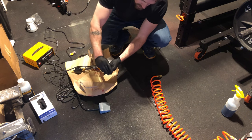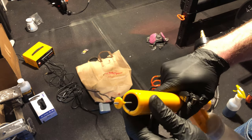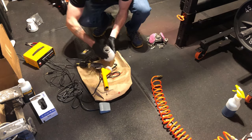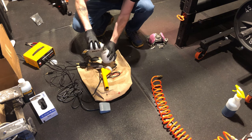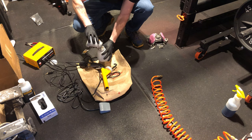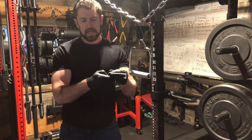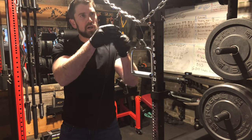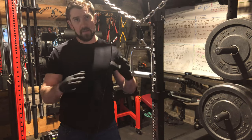Make sure that when you put the tip on, you don't put it on with the cone facing out — you want the big end out. Once you have the tip screwed all the way down until the threads end, you're good to go. Next step is filling this with the powder. The cool thing is that if I drip some somewhere, I'll just blow out the garage later and it'll be gone. Now that I have the powder in there and it's all hooked up to the compressor, I'm going to hook up this ground line. What it does basically is — there's a pedal that you step on that comes with the system, and it electrically charges the project we're working on so that the powder sticks to it. Whenever you're spraying, make sure you have your foot on that pedal.